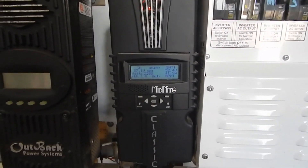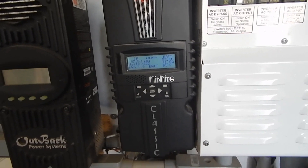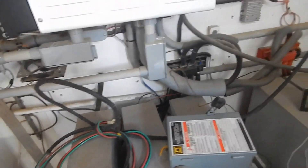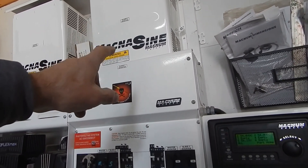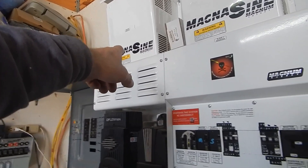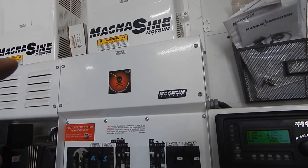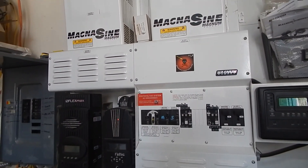The Midnight Solar surge protection devices have been installed - one more item off the list. There's a lot going on: I've got wiring on the bench - that's 240 volts coming in for the big generator. This switch is going to go up on the wall. With this Magnum system, you can run 120 volts and charge at 50 percent rate, or run 240 volts and charge at 100 percent capacity. I'll have these all hooked up for 240 with a breakaway switch for my small 25-amp 120 service. The wall layout is being done in the background - more to come, but the SPDs are installed and we're back in business. Thanks for watching.